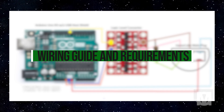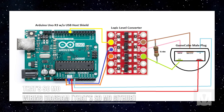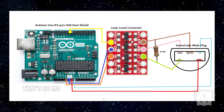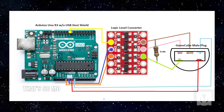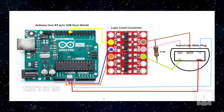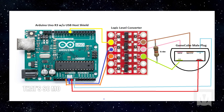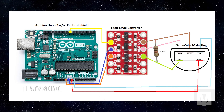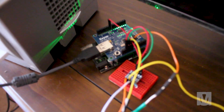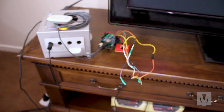This is the wiring diagram. The logic level converter is needed to convert the 5V data logic voltage from the Arduino pins to the GameCube's acceptable data logic voltage of 3.3V. You will also need a 1K resistor between the 3.3V and 3.3V data logic pins. The diagram is almost identical to the one created by Brock, Simple Controllers, except I added additional wiring to allow the GameCube to power the Arduino. This way, there is no need for external power, which means a much neater experience.